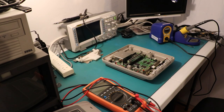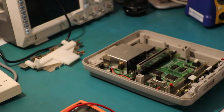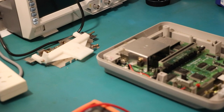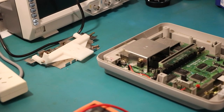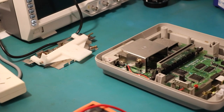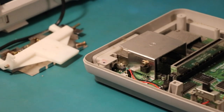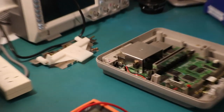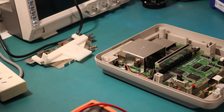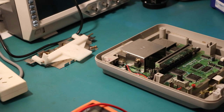Alright, so you've made it to the bench. You've already half disassembled your console. So as you can see, we've got the bits and pieces over there. Metal shielding for the lower half, covering the chips. Eject thingy-me-bob. Honestly, I don't see why they needed that, but that's fine. So let's have a look here at the Famicom of the Super variety.